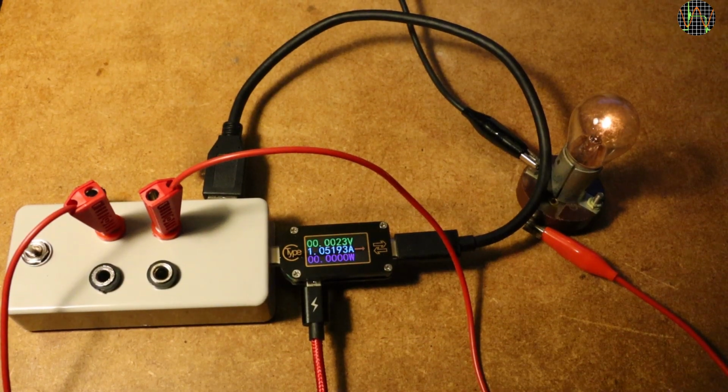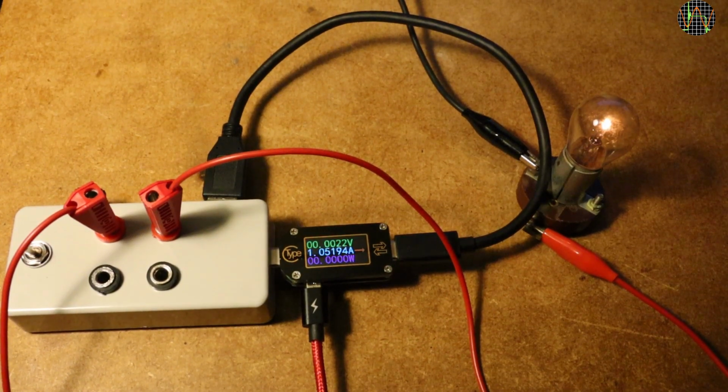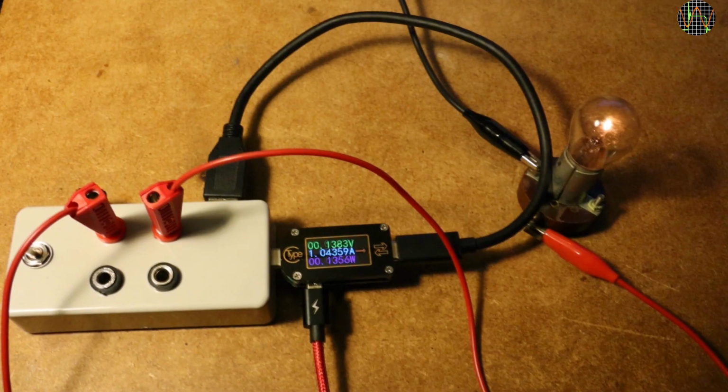Here's how that looks in reality. Note that in this mode you have to ignore the voltage and power readings because the voltage input is just floating and can pick up noise. It's not bad if you power the TC66 from a power bank, but it can get a bit more when connected to a PC, while the power supply providing the current is also adding some stray voltages into the mix. It doesn't affect the current readings, but it's kind of distracting.